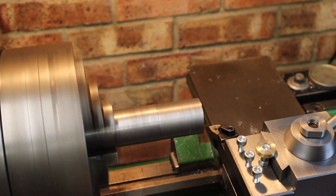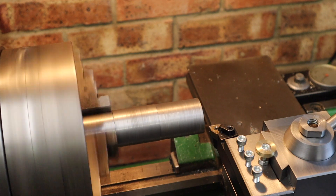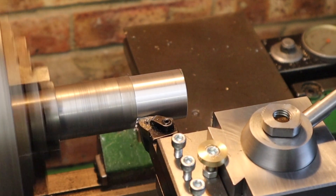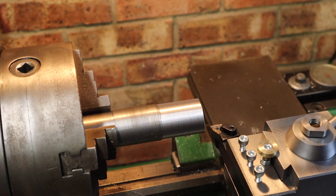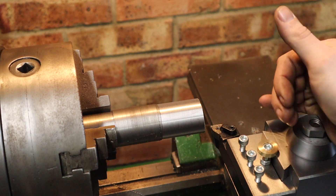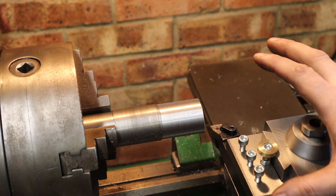Just touched up on the work there — this should be no problem for this lathe. I'm going to start off with a 1mm depth of cut and this is all going to be done under power feed. That's not an overall bad finish for a 1mm depth of cut. Didn't seem to have any problems from the tool holder itself — all seemed to stay pretty good. So far so good. The next thing is to step up the depths of cut in increments.